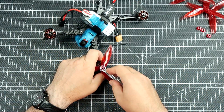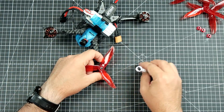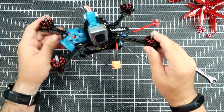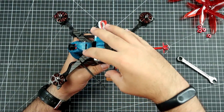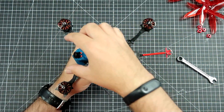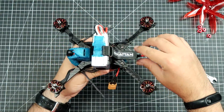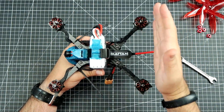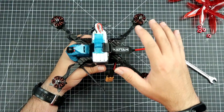It was designed by a dude — I think from Madrid, definitely from Spain — and was designed to equalize the moments of inertia on all axes. Because if you have the battery on top or bottom and the frame is longer, you usually place the battery on the longer axis, and this makes a huge difference in the moment of inertia between the pitch axis and the roll axis. That means you need much higher P and D gains on pitch than on roll, and you can really feel that the quad behaves differently because of how the mass is distributed.